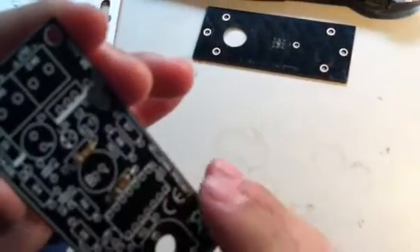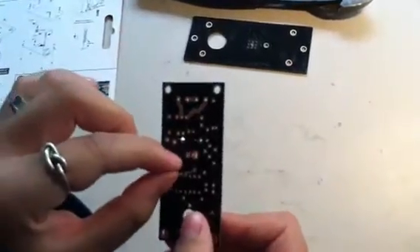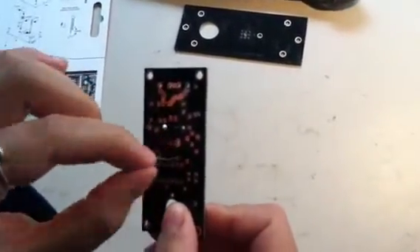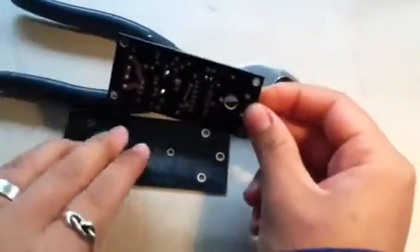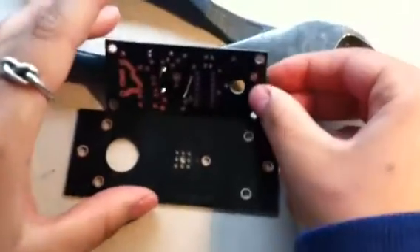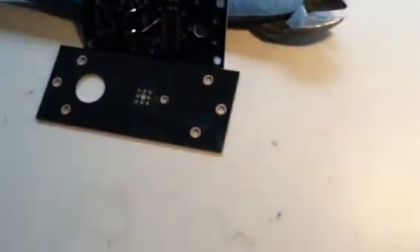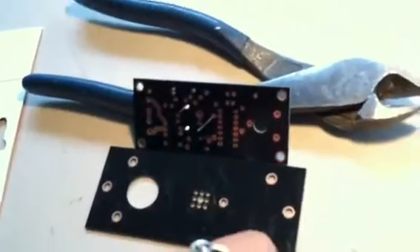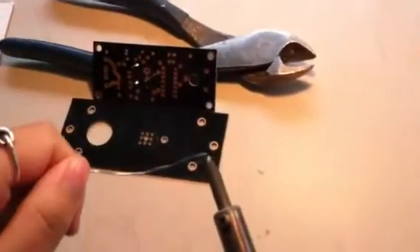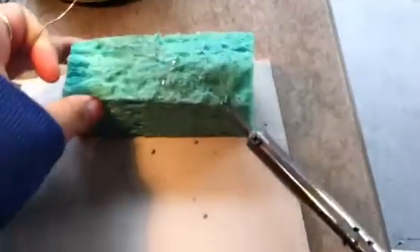Make sure it's secure, then you're going to flip your circuit board over. Use gravity as your friend once again so that the solder will spill away from the joints. And you're going to begin soldering. The first thing — if you remember from the first part of my video — is that you need to tin the tip of your soldering iron. Wipe the excess on a wet sponge, and you're ready to solder.